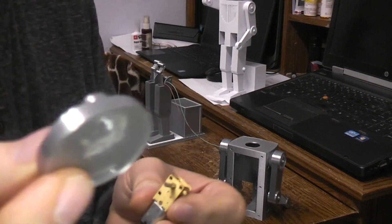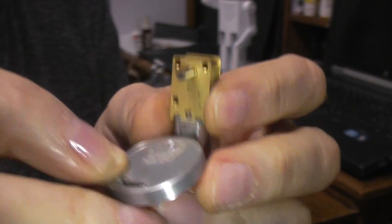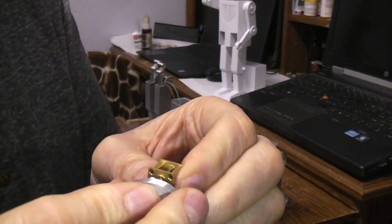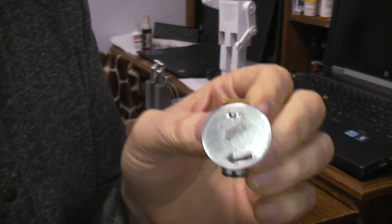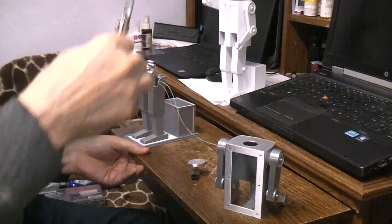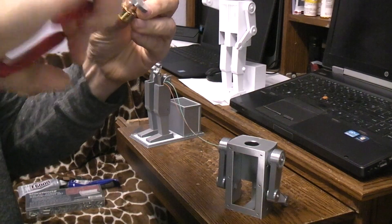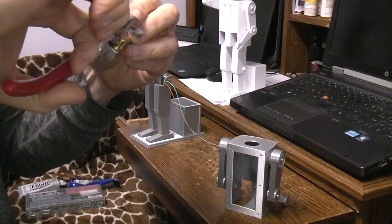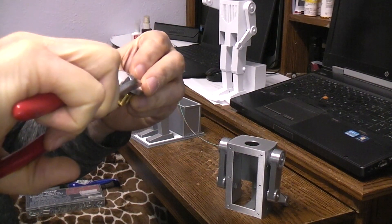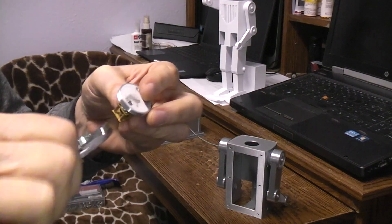There's this cam that we have to fit onto the motor. You can see this shaft — it's called the D shaft because it has a flat, and this cam has a flat as well. The cam also has a rotation arrow on it, which is going to become important when we wire it up to the batteries. This cam has to rotate in a clockwise manner when you're looking at it from this side. To fit it onto the shaft I'm going to need to press it on — normally I'd use the vise, but I'm here in the house so I'm going to use pliers to press it down on there. A little bit further, a little bit more. I've got a little bit of shaft hanging out there, and I know it's not so tight that it's binding up on the end of the motor itself.